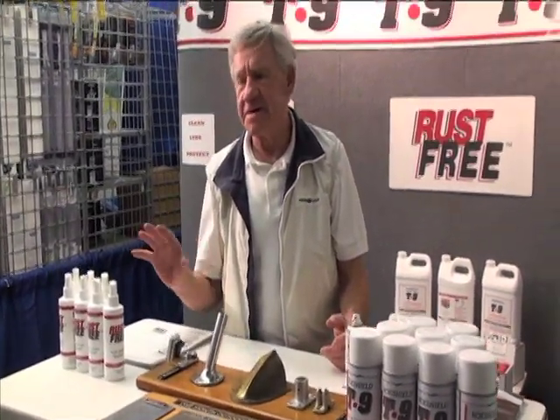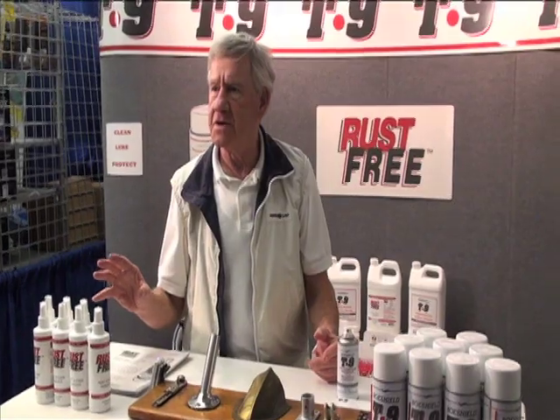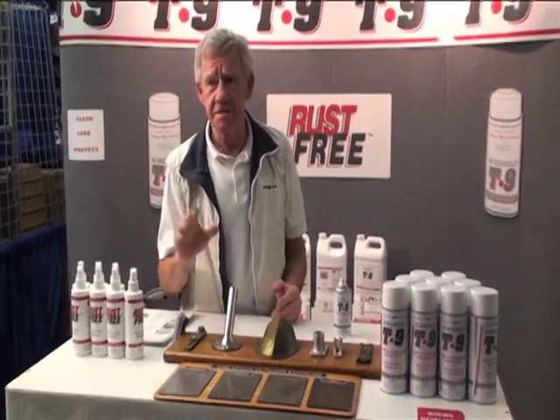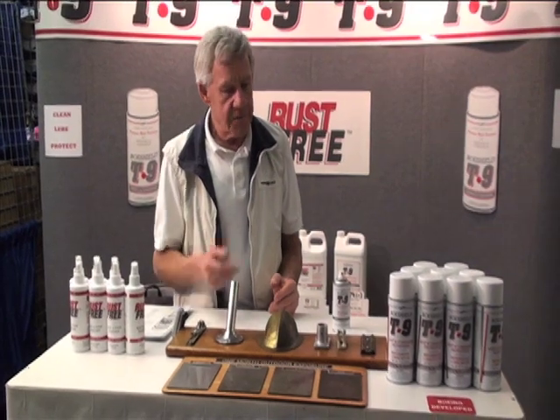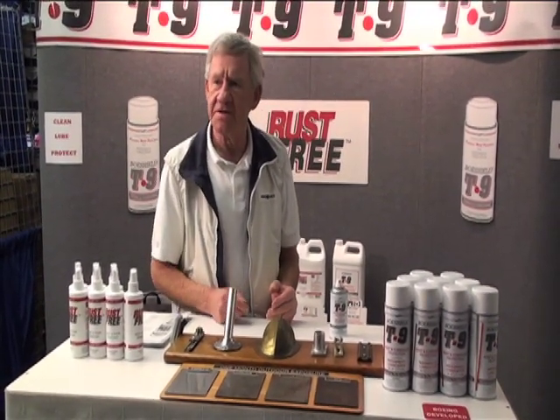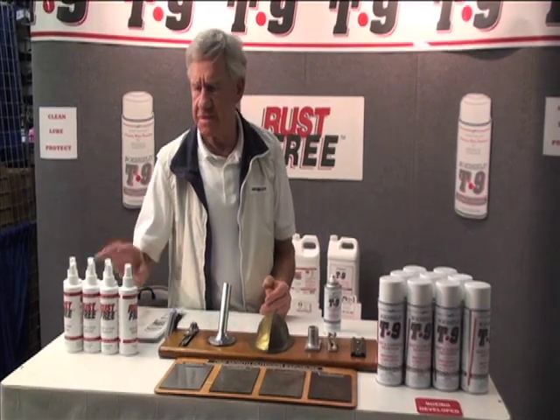You've got to be a little careful — it's phosphoric acid-based, so you don't want to use it on guns because it'll remove bluing, or on plastic surfaces. But for metal, for steel basically, or for staining around those stanchions and so forth, it does a great job.